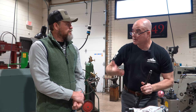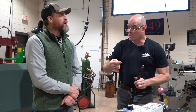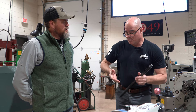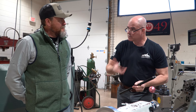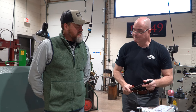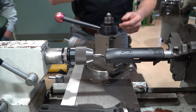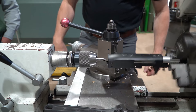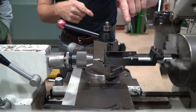Next we can go ahead and modify the receiver. One of the little tricks we'll do is drill a hole in the back of it. One of the shortcomings of the 10/22 is you can't clean it like you would a bolt action rifle — where you can take the bolt out and clean from the breech to the muzzle as you should. With a 10/22 you've got to come from the muzzle to the breech. So what we'll do is drill a hole in the back of that receiver absolutely in line with the chamber, so you can pull the barrel and action out of the stock and use a conventional cleaning rod from the breech to the muzzle. That way you don't create any wear to the crown or muzzle.